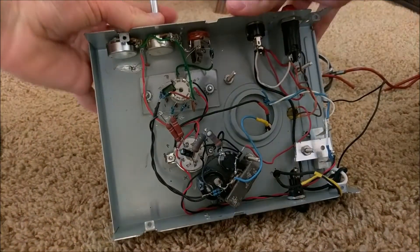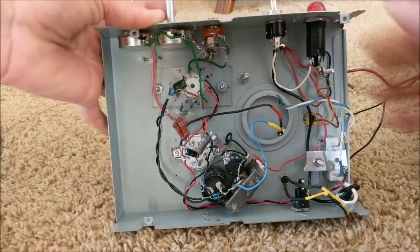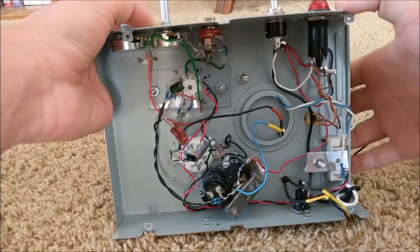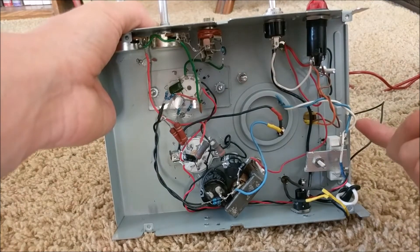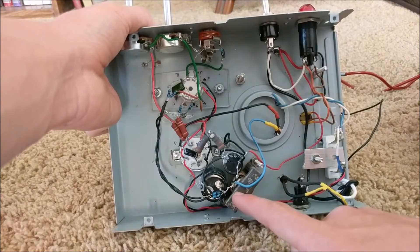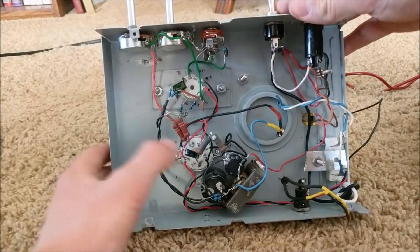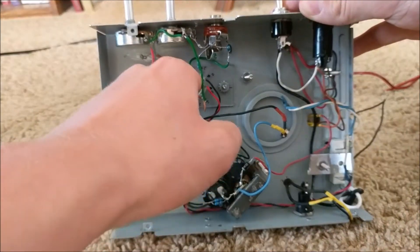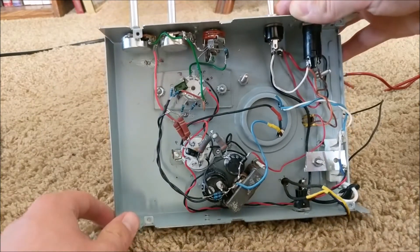On the back we can see all the electronic components inside. There are lots of holes where the wires from all the transformers come in. We also have a dropper resistor that takes the higher voltage from the filament transformer and, due to the current flowing through it for the two vacuum tubes, lowers the voltage to the required 6.3 volts. There's also an inductive choke to remove noise from the line, and ceramic tube sockets bolted in place. The smaller socket used a piece of plexiglass to hold it to the frame.